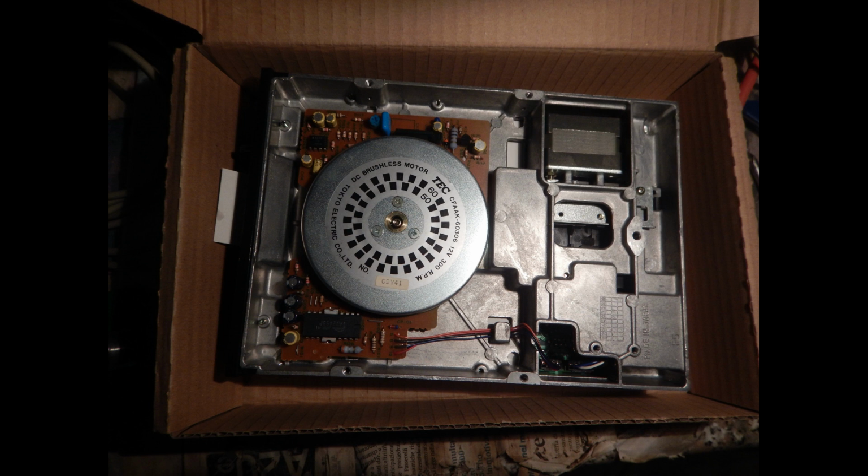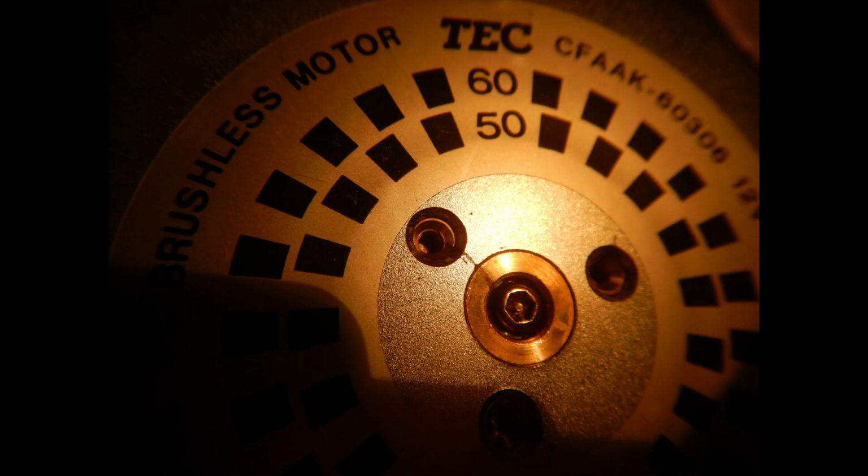Now it's time to remove the spindle motor PCB, because I want to test the capacitors on this second board and inspect the traces. To do that, I must first lift the spindle rotor, so I removed the 3 screws holding it to the motor body, and then marked the position of one hole with a pen. In this way, I can reassemble the motor in the exact position. It's maybe an unnecessary step, but it's always better to put things back in the original place if possible.